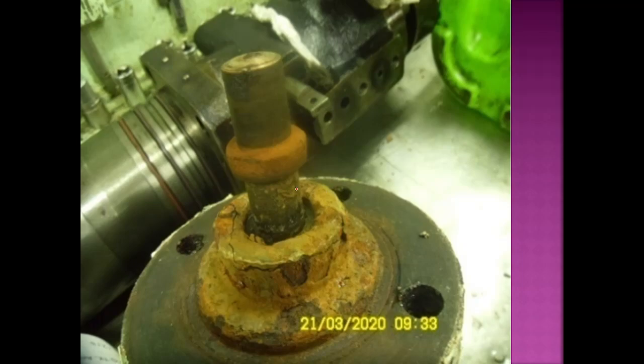This is basically the SDNR type. As you can see, this part is basically a guide for top and bottom movement. The spindle from the top can move maximum to this position. When it is open it will be in this position, and when it is coming up with the water pressure it will come here. This is the guiding part of the valve, which will get inside the valve seat. This is the area which acts as a sealing area. The spindle or stem is here normally in open condition, and this is the playing area on which it will open and close depending upon the water pressure.